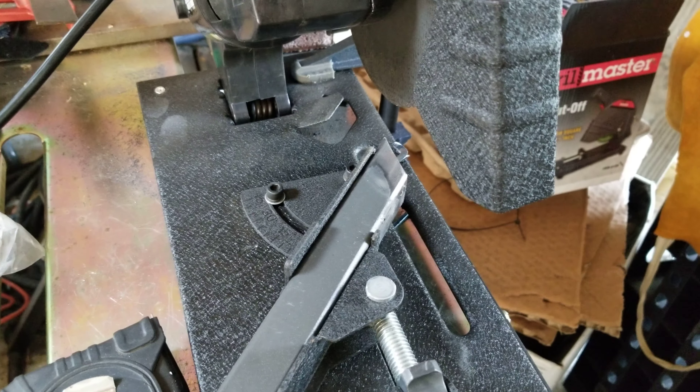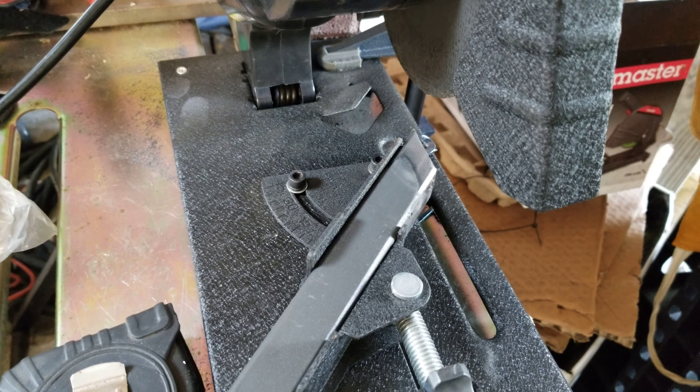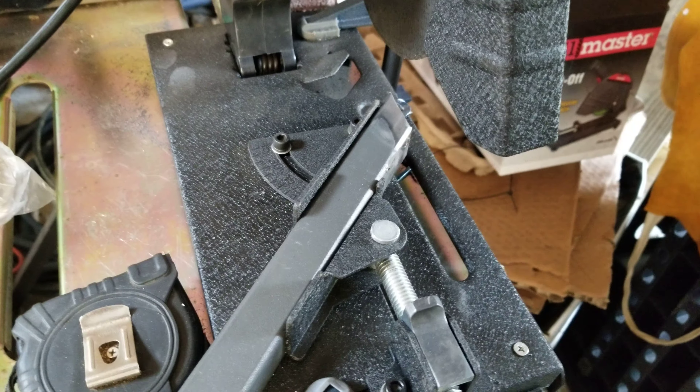This is only an eighth-inch thick piece of steel — pretty decent material — so it'll cut it with no trouble except a little bogging at the end. For the most part, let the saw do the work and you'll have no problems. It's not a bad saw for small projects. If you're doing bigger stuff, yeah, the 14-inch will be a lot better — more cutting capacity and a stronger motor, around two and a half to three horsepower versus whatever this one is. This is good for what it is: small projects, welding up little stuff, some rebar. Don't overtax it, let the blade do the work, and it does its job. Thanks for watching — talk to you later.